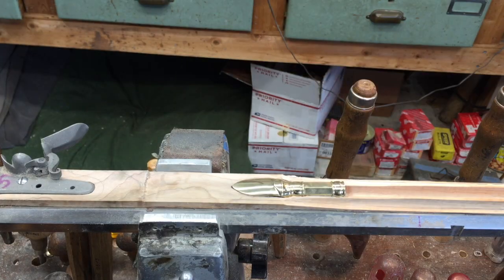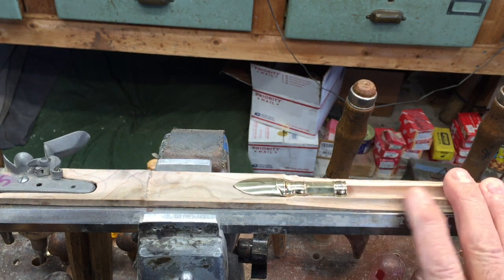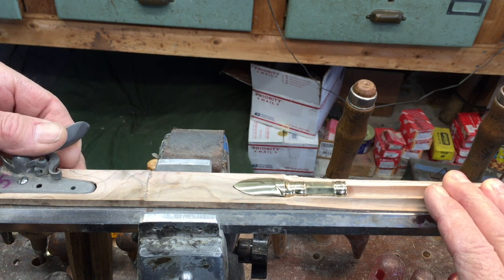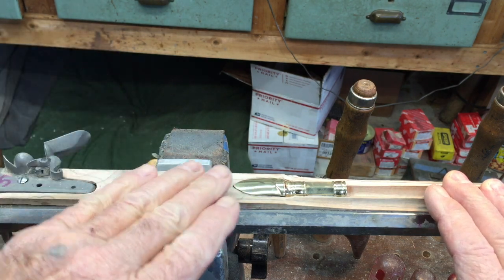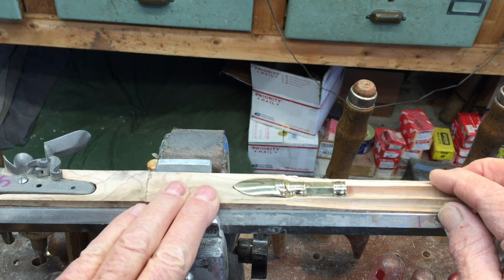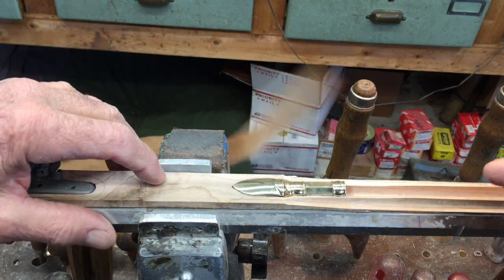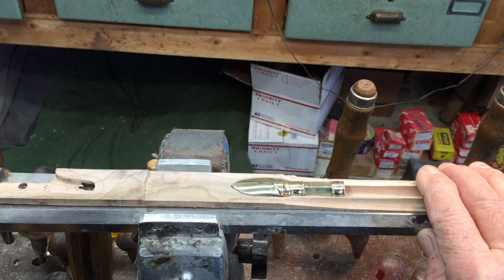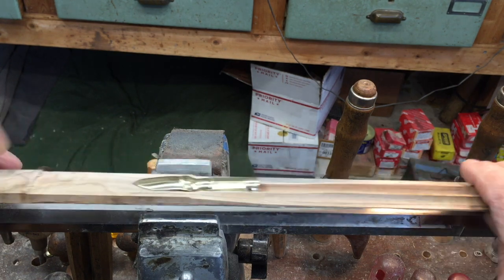All right, now that we've got all the thimbles in, we've got the side panel grooves all the way up beyond the lower thimble. The lock plate is in, or I should say the frizzen plate. We're going to have to deal with this section right in here. And this is probably the toughest part of the whole building of a swivel breech. The loading stick hole is so close to this surface, you've got to be very, very careful. I mean, super careful.